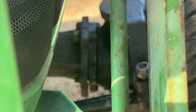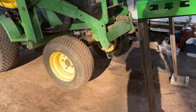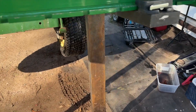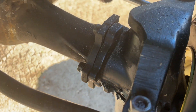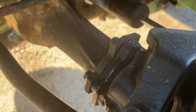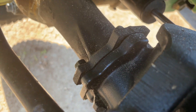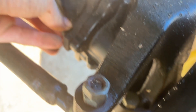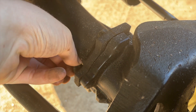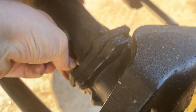So I'm definitely not going to drive it anymore now that I've noticed that. I'm going to go ahead and jack the front of the tractor up off the ground and see if I can find some bolts to replace the missing ones and tighten them all up. With the front tires lifted up, you can really see how loose this is — the gap is opening and closing just by me lifting the wheels a little bit, and the bolts that are left are literally hand tight.